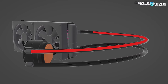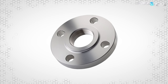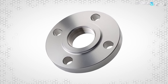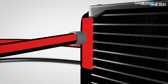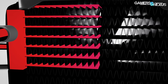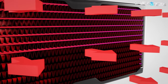Getting back to the basics: liquid moves up one tube and into the water tank on the radiator, which has a partition wall down the middle. The tube mounts to the radiator on a barb, which is generally either a three-flange or single-flange design. Single-flange designs are used most commonly in server and data center use cases, with Asetek leveraging piano wire to pinch the tube like a clamp. Three-flange barbs are still rated for several times the pressure ever experienced in an enthusiast desktop, so they tend to be more common for consumers. As the warmed liquid from the CPU feeds into the radiator, it travels down roughly half the channels. Aluminum fins within the radiator core conduct heat away from the channels, and the radiator fans dissipate that heat. You may also hear the phrase heat exchanger or HEX — it means the same thing as radiator in this context.